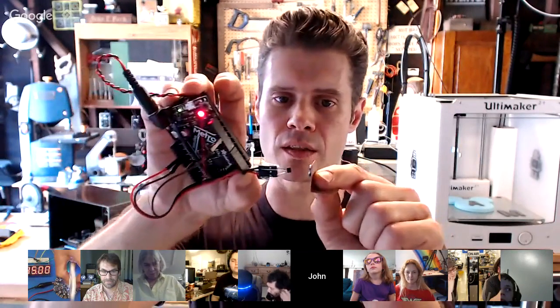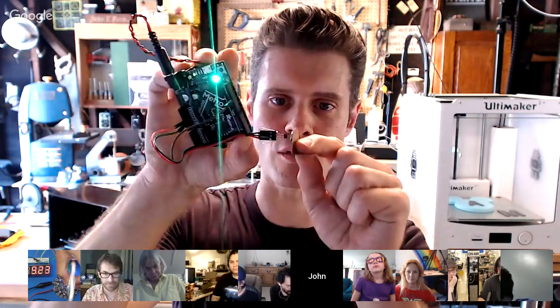And this is super useful when you have things that are embedded inside of objects that you want to trigger with the end of a magic wand or with a little secret magnet that you have in your sleeve. So I really like using these. They're dead simple. It's like $2 for a Hall effect sensor. You use a resistor, some wire, and you've got a really reliable button that never takes any wear and tear. And as long as you know which side of your magnet activates it, you can trigger things all over the place. Okay. Outstanding. All right.